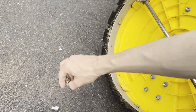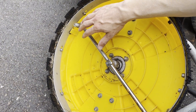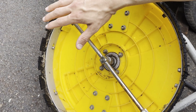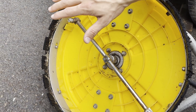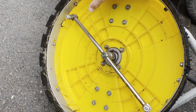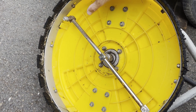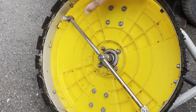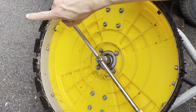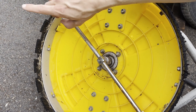I like to run a little bit higher orifice than the flow rate of my machine. I find that it actually allows my machine to open up its legs a little bit and work more efficiently, and my machine is actually rated for higher PSI than what's recommended on concrete. On concrete you should be using no more than 2,500 PSI, but I run about 2,000 PSI on a daily basis and that works absolutely fantastic. Running oversized tips allows better flow and slightly reduces the pressure of your machine to a more desirable cleaning pressure.